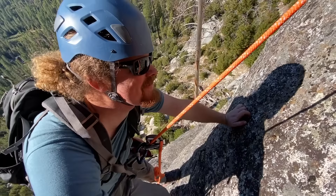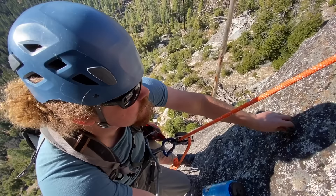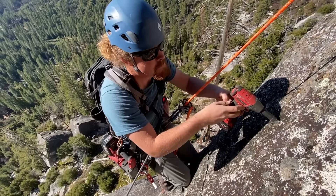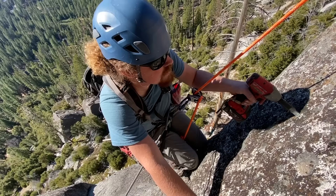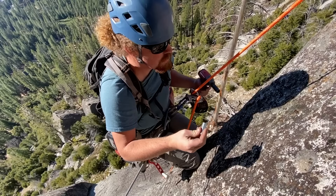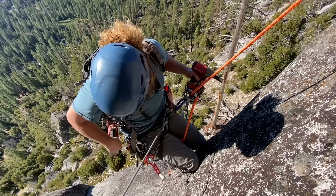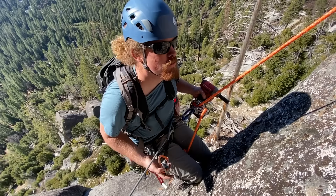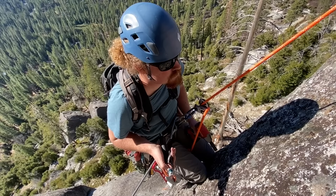So you attach that — it's basically female on both sides. We need to use a different method, because that's just tightening it on there, trying to pull it out of the rock. The problem is you're engaging the cone, and I don't want to find out it snaps. I think it would break. We really want to reuse the same hole, so we're going to spin it with my rotary hammer drill.